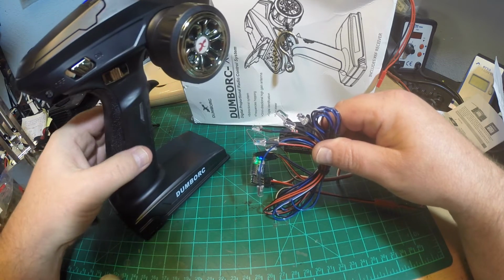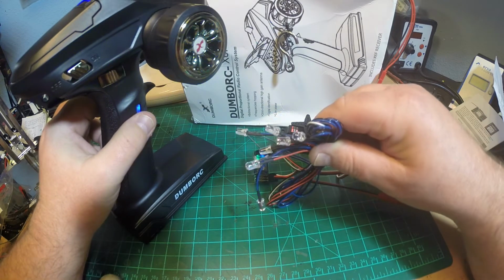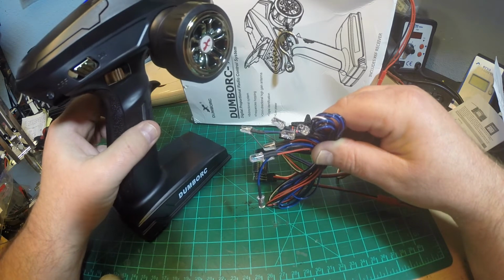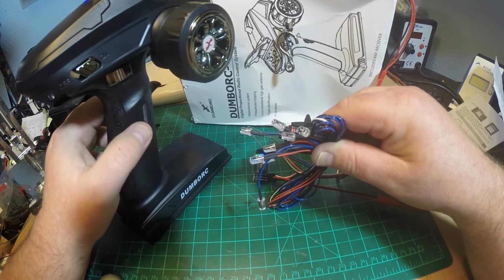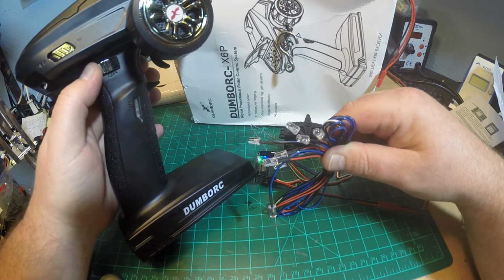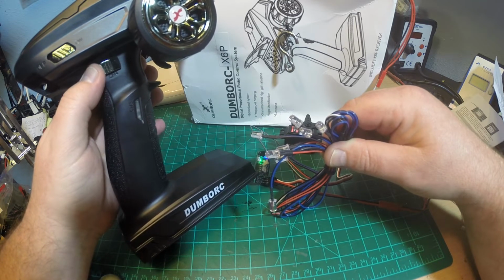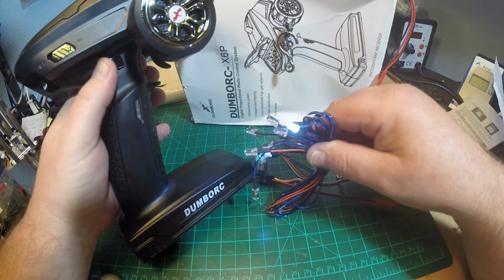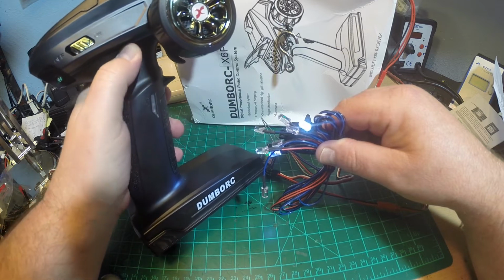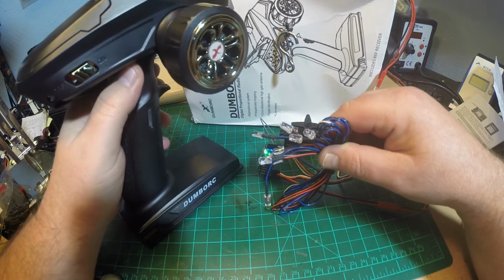But what's quite cool, with channel 3, the push button, you can switch on hazard lights and switch them off again. But there's the question, why is this on channel 3, the push button? Because channel 4, the only 3-position switch we would need so urgently for a speed controller to control a winch, this switch is on and off the main beam, the headlights. On the left side they are off, and center and right position they are on.